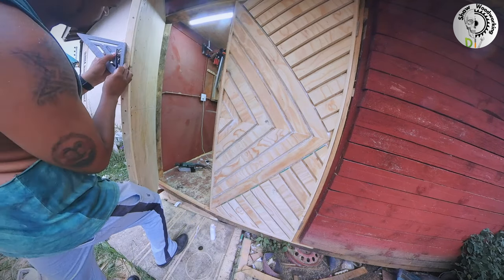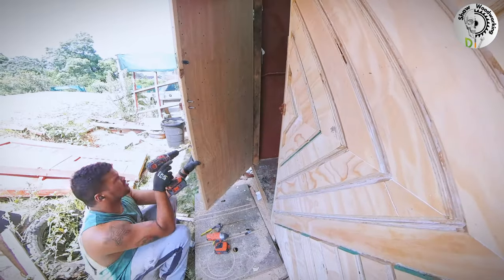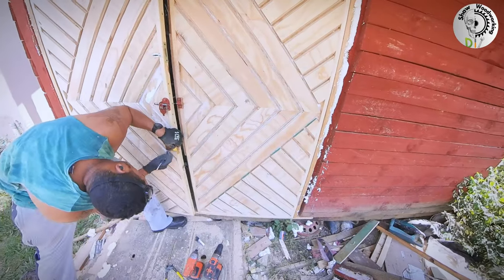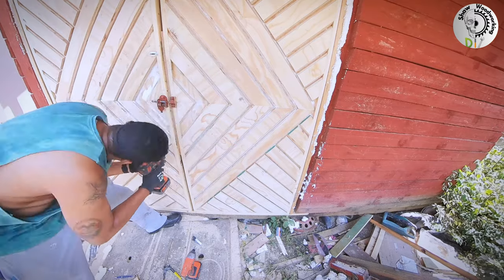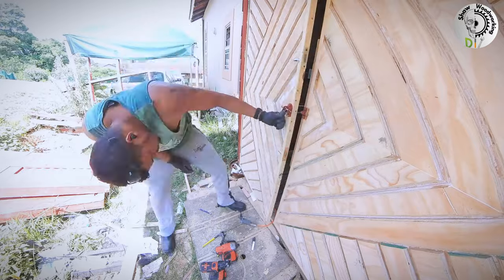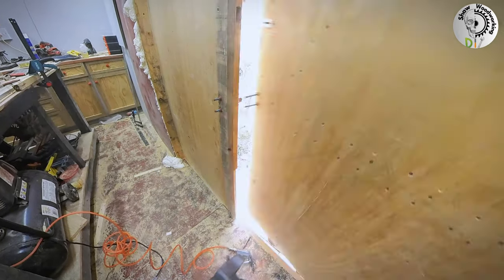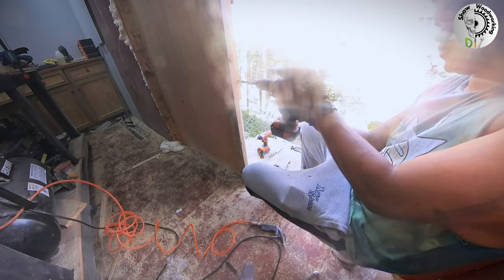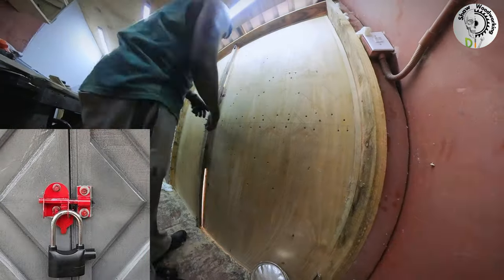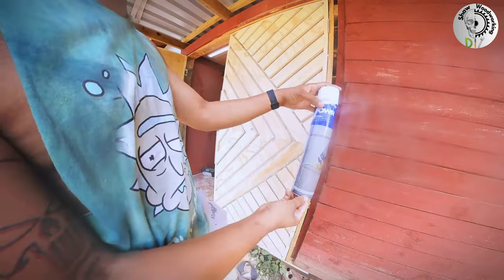Installing the deadbolt is pretty interesting — this was my first time doing it. We find the center on the door, use a drill bit that's wide enough for the lock itself, and remove all the material. You can also use chisels, but I don't have any. Then we make the slots for the keys, insert the lock, and make pencil markings on the bolt part of the lock. I close the doors, turn the key slightly — this leaves markings on the other side of the door. Then I use the drill to hog out that material, and we're pretty much done with the locks. I also added a latch with an alarm padlock off camera.